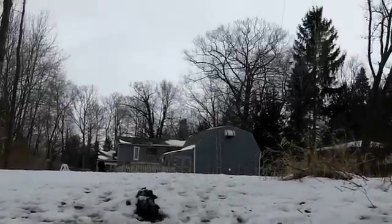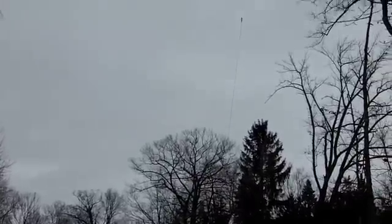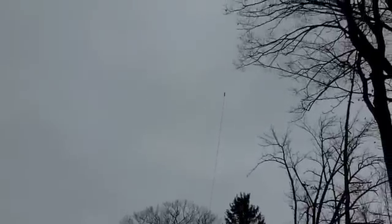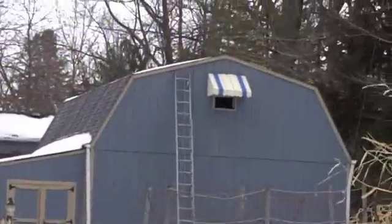There's a better shot of the feed point in comparison to the barn. The 80-some-odd foot section — it's a 64/36 ratio, so 64% and 36%. It's 134 feet total — 80-some-odd feet plus 40 feet. The 80-foot section runs from here back to the barn, attaching itself, and then the 40-foot section runs up this way to the tree over here.